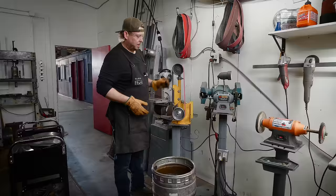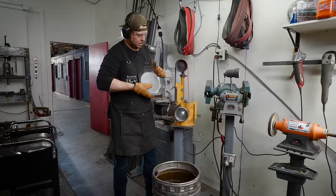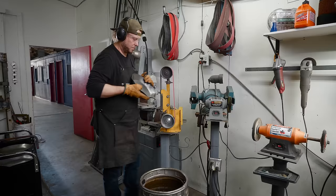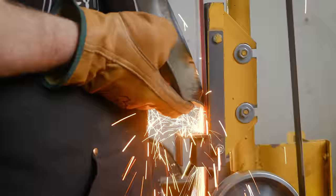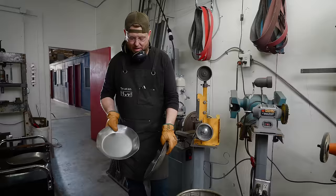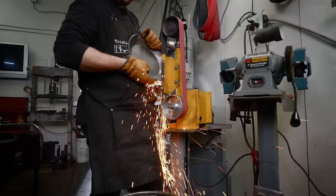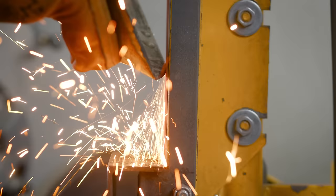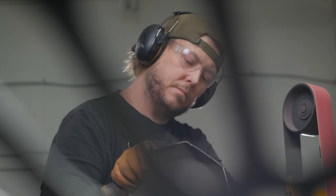Now that we've got these hybrid pans pressed, we actually need to do some grinding on them. Right now they have this scalloped area, and we like to make that flat — it just makes it look really nice. I've knocked off these scalloped edges and you can see the difference between the two — it's pretty pronounced. The reason we do this is because that extra little piece doesn't add any function to the pan, and when we take it off, it looks beautiful and also helps to create a better pouring spot while you're cooking.